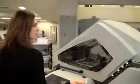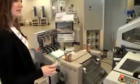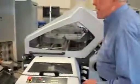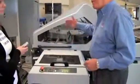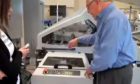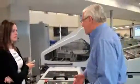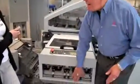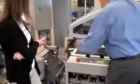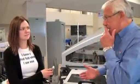I am producing a 16-page signature in a very small footprint. This is 6 plates on the parallel. I have a knife and a fold plate under the knife, and I have another knife. So I don't need all of the right angle sections. I have a parallel exit, an 8-page exit, a 16-page exit, and if I took a mobile knife unit, I'd have a 32-page exit.